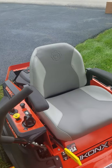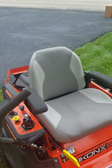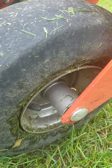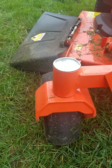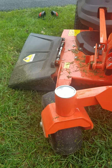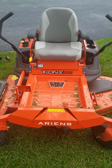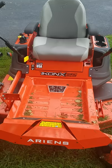I had a John Deere LA-130 before this — it was a 48-inch — and I had it for like 13 or 14 years before the sector gear kept going out and I couldn't turn it anymore. There are grease Zerk fittings for the wheels, which is nice, but there are no fittings for the front casters, which I'm hoping won't be a problem — I just keep my fingers crossed. It is bouncy, but there is no suspension whatsoever. At least my John Deere riding tractor had a center pivot point — it was like a Cadillac compared to this thing.